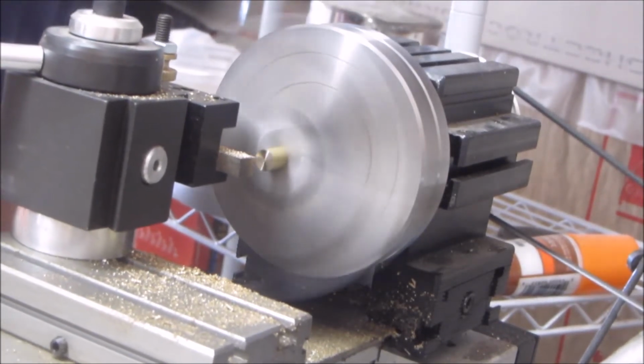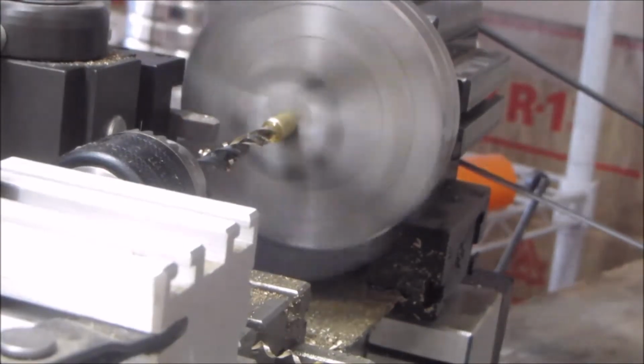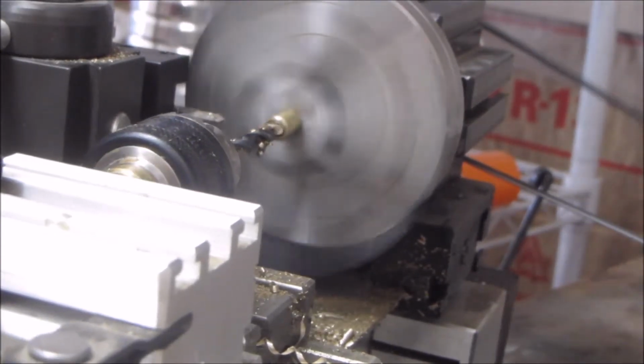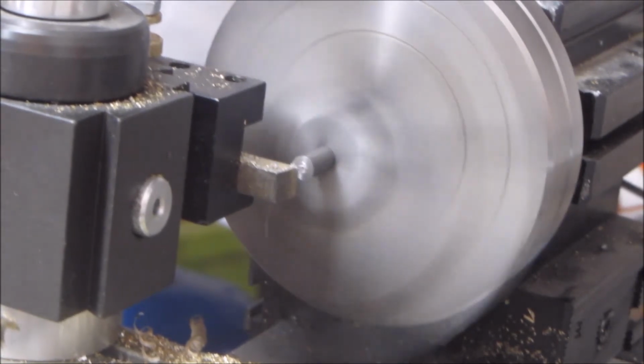This way I can create an interference fit during assembly by heating the brass a bit with a torch. Once I had cleaned up the ends of my tip stock, I shaped the sculpting tools on a belt sander and polished them on my lathe with progressively finer grits of sandpaper and micro mesh.